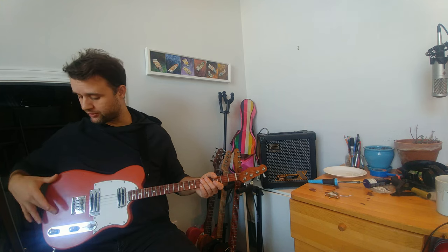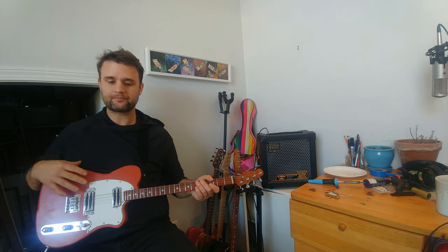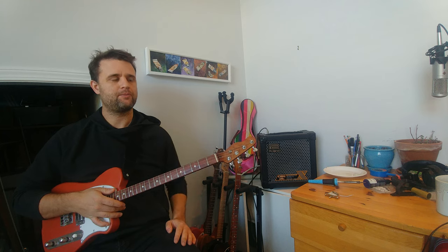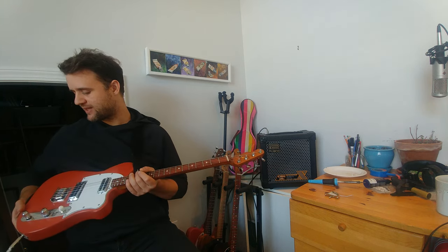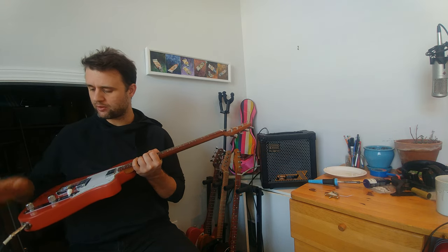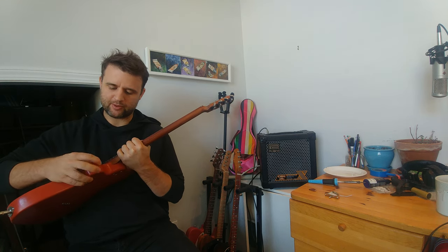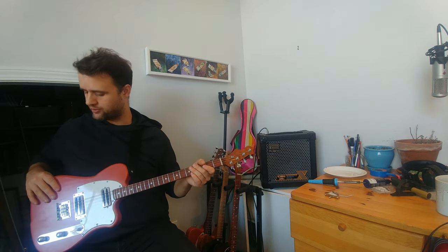There's a two-piece alder body with a coral-colored milk paint, an opaque kind of application — about six or seven layers — sanded down to level, with poly on top of that, and then wax to buff it all out. I use steel wool to give it a bit of a satin finish, which is what I prefer. I don't like super glossy finishes, and that's where this guitar is right now — it's very satiny and feels really good.